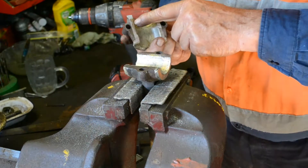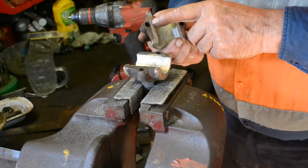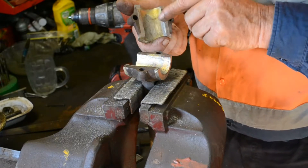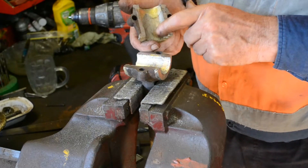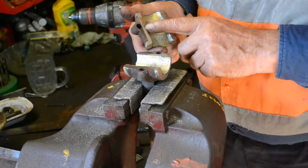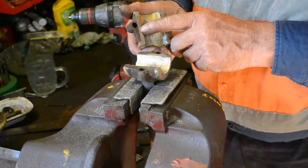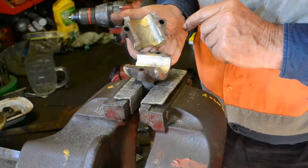You don't have to worry if they don't clean up here because we're going to put shims under here and bite down on the steel. The bolts are going to tighten up between the two steel faces, not on the white metal faces. Remember the white metal is bonded to the steel and it dissipates the heat. There's a fair amount to come off — we've got about 3mm thickness there between the steel and the white metal when it's finished, so we've got plenty of metal.